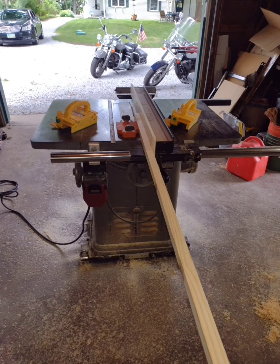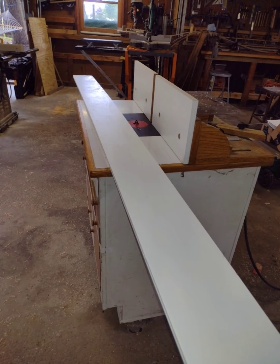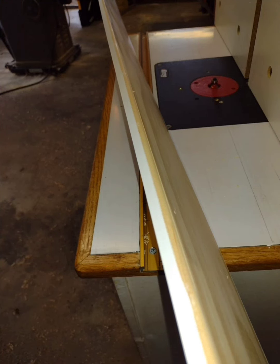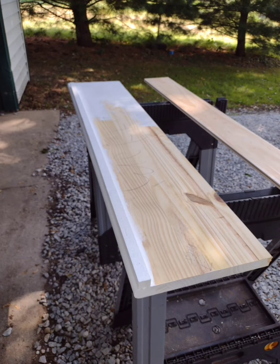The jambs on one side — I decided I was going to run a radius down one edge of the outside edge of all the jambs, just to clean it up a little bit. Pull the clamps off the threshold plate, sanding it up, painting it, then cut it to size and paint the ends right before I put it in.